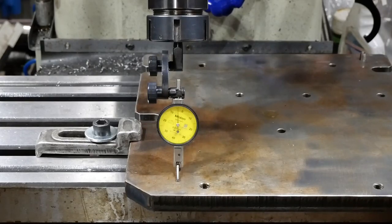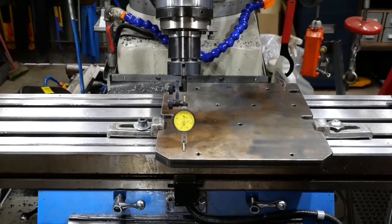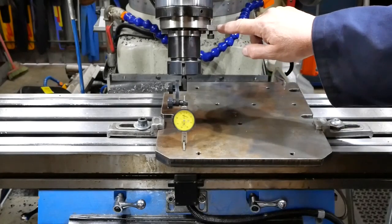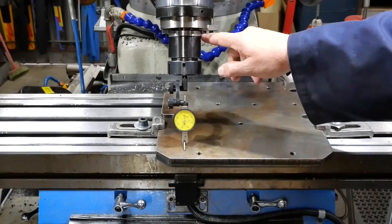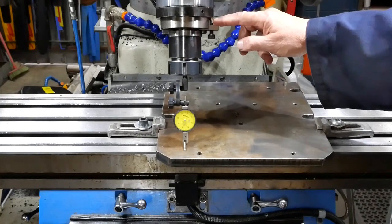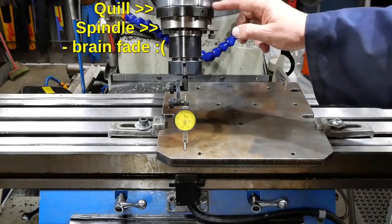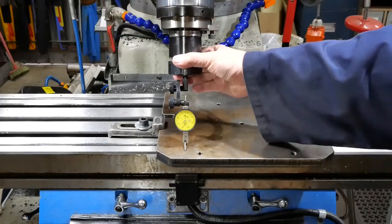I should also mention, there's another variable otherwise. Perhaps you can see here, this is a little clamp arrangement. It just locks in, replaces one of the drive dogs and jams a brass thing up against the underside of the quill to stop rotation, so that eliminated one possibility.